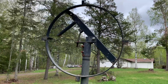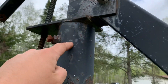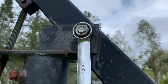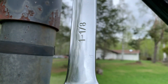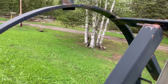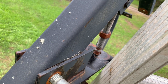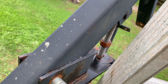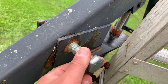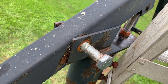Now we'll get the mounting ring off. I'm going to loosen this bolt right here that holds it on to the bracket, and then this piece can just come off with the steel post. These bolts are pretty big — you need a 1⅛-inch wrench for them and a lot of elbow grease. I used a hammer to tap the bolt through, but I loosened the nut on the back of the elevator bolt so I can rest it back in the cradle and sit it on this platform. That way, when I pull this bolt out, the whole assembly won't slide out and fall, and I can have more control over it while I'm lifting it off.